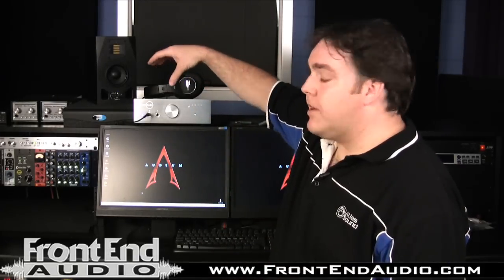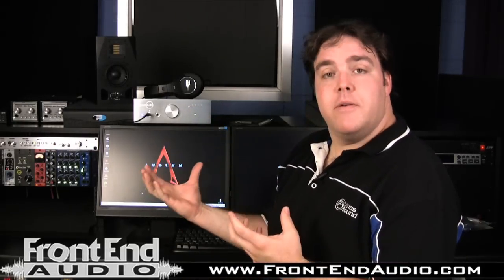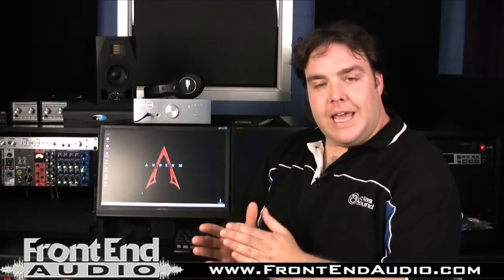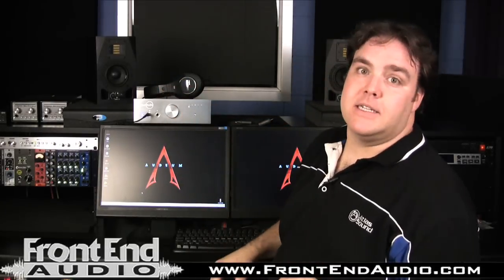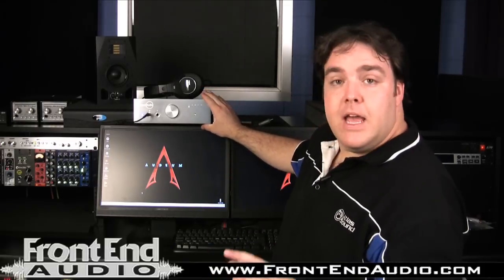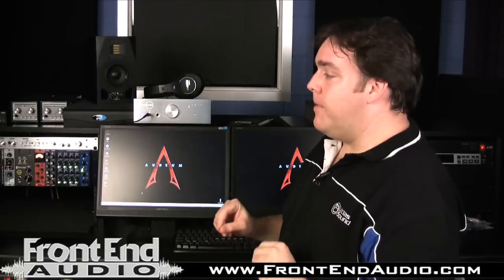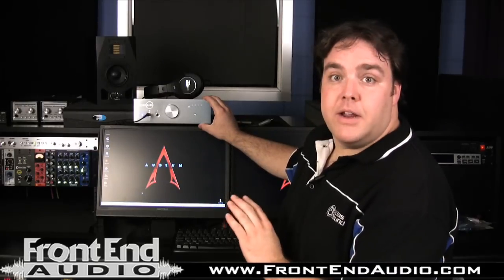But power supply wise inside, you're going to find that there are two large honking transformers in here. One of them is dedicated to the analog side of the circuit. The other is dedicated to the digital converter side. So they keep those two paths separate. Beyond the transformers, there are actually five different power supplies inside of this, dedicating from the transformers and the rectification off to different components inside. So that really helps to maintain clean power. That's one of the things about this device: it is dedicated to creating clean power. A lot of devices would rely on an external unit to provide that for them, but power supply is something that Burson Audio takes very seriously.